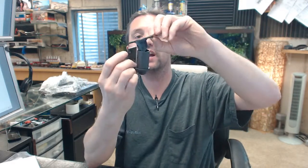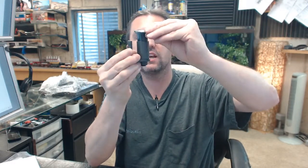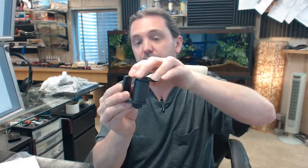The way that that's accomplished is they'll take this miter and flatten it off here, and on the inside of there, the other cam that's inside of here. So when you rotate it out to 90, it gets to that plateau or that flattened off area and it will just rest there. This will do it because I've got it past 90 degrees, plus there's no weight of the door on top of it. But that's the only difference in the hold open feature that's here.